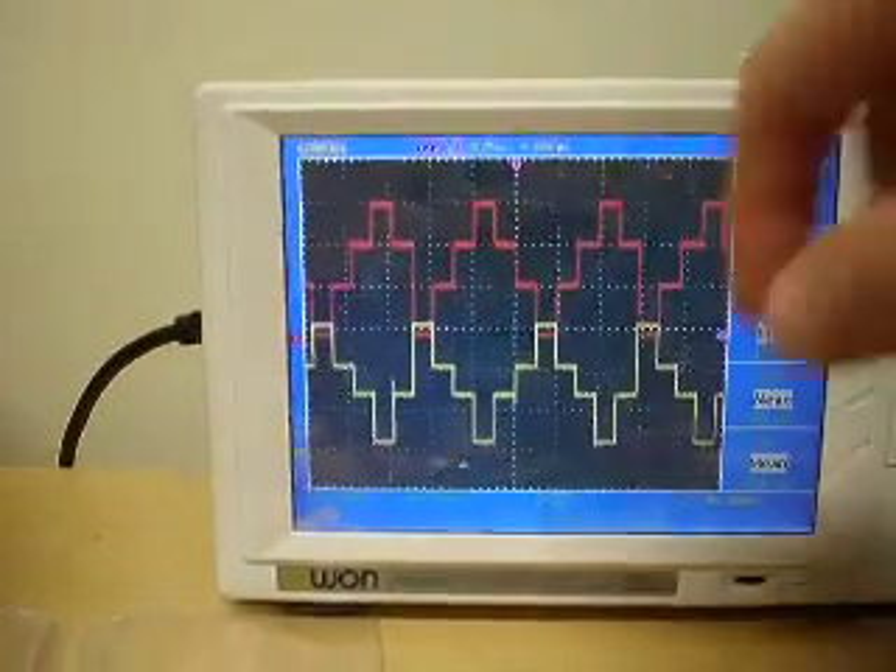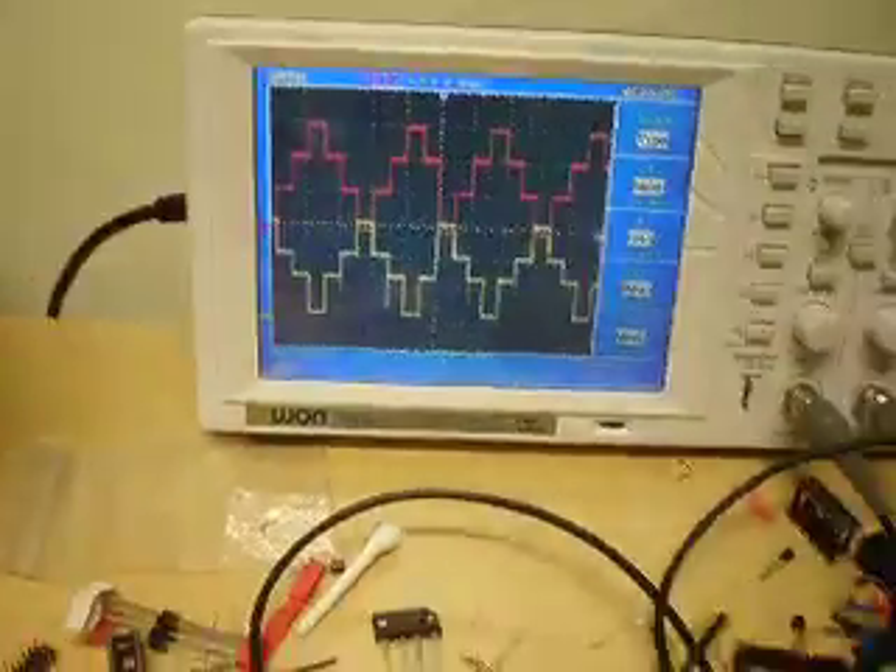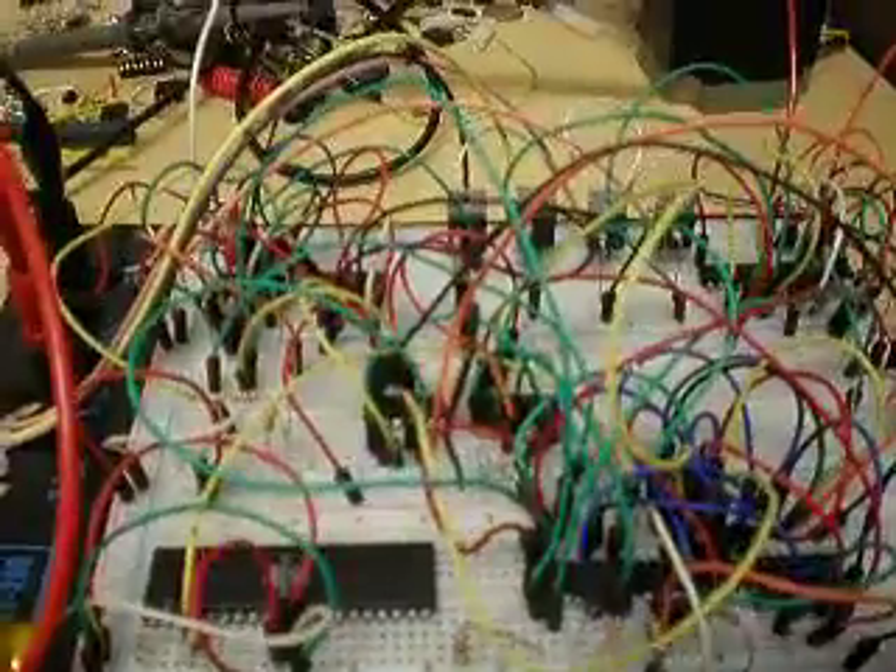It's not staircased, so that's one thing I'm working on. Also I think I'm using too many gates and they're feeding off each other too much, so I need to put some pull-up resistors in there. As you can see I already have over 50 resistors in there just for the pull-up and op-amp configuration.